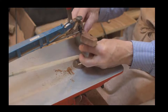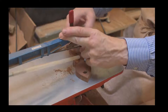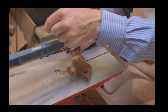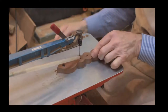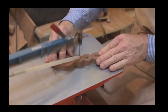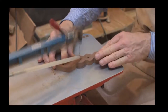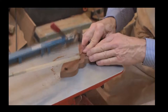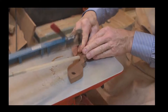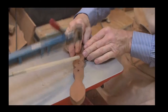You can see how it's taken shape - we've got that outline profile around the outside and we are now working on those internal cuts. You feed the blade into those internal cuts, use the quick release on top, add the tension back to the arm after you've fed it in, cut that basic profile out, and basically job done.